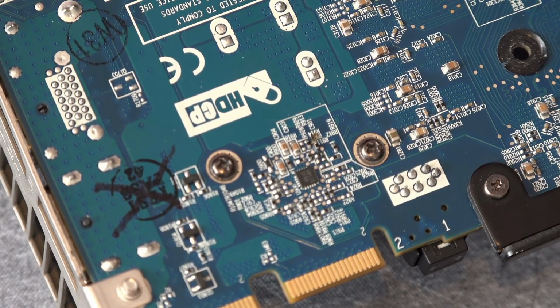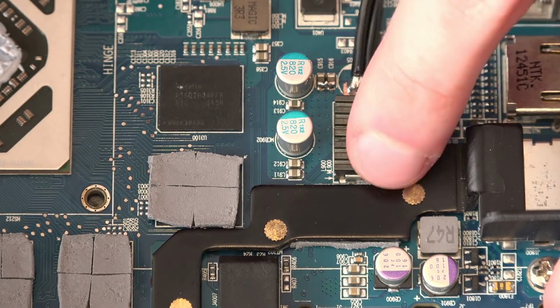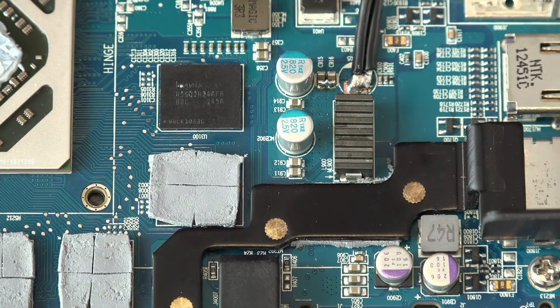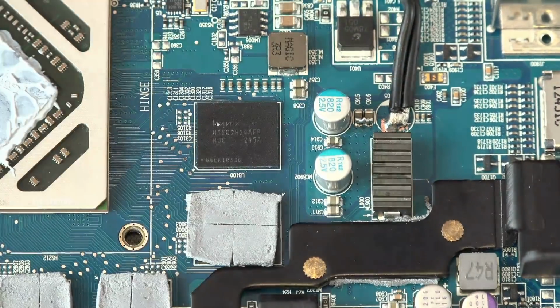I think this probably uses the DC resistance of the inductor itself. So essentially, that is relying on the resistance of the choke right there to monitor the current flow through it, and use that for current monitoring. So working with that assumption, I started looking for a circuit that looks like that.